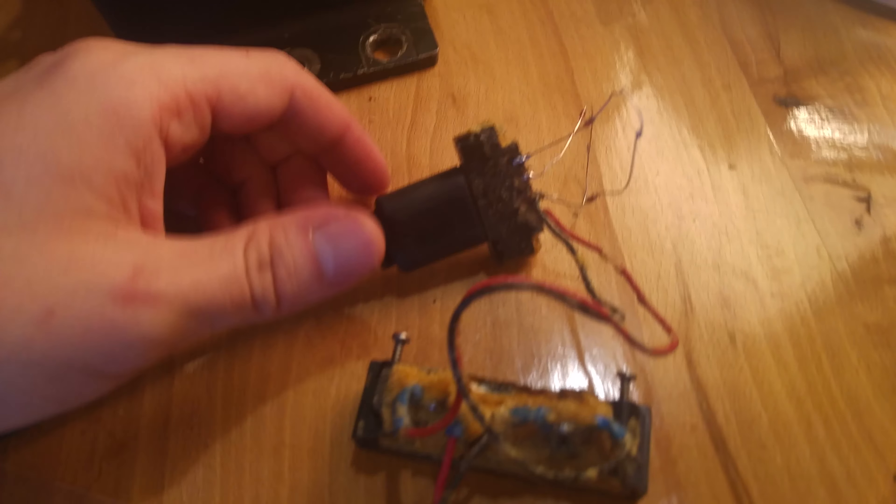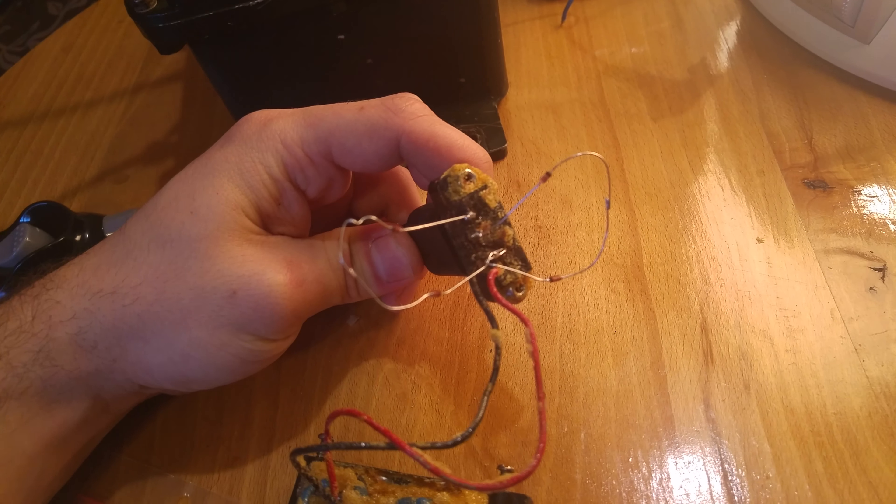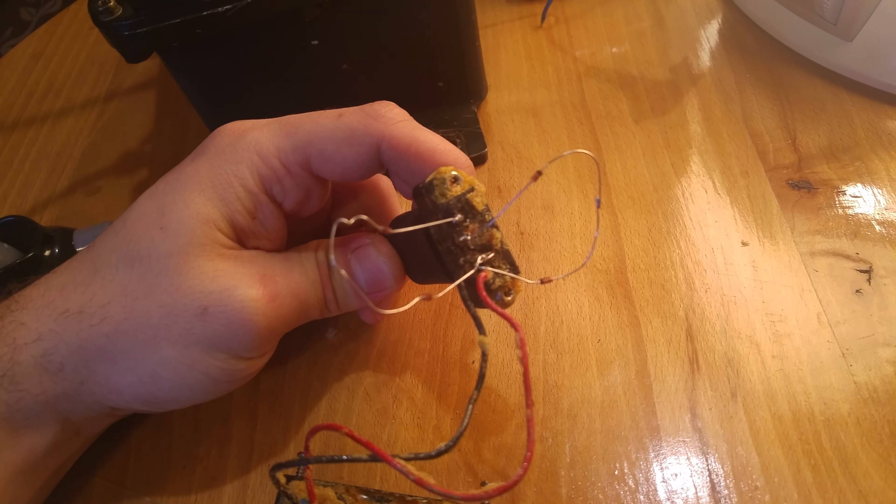Let's see how they are detecting the charging — it's quite simple. They detect the change in voltage drop across this diode. There are two diodes in series getting about 0.9 volts of voltage drop. The negative side goes to negative, and we've got our cold detector and our hot detector.